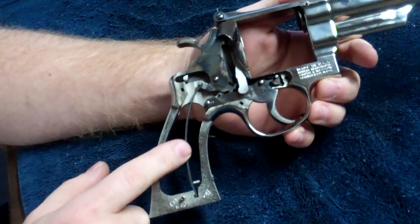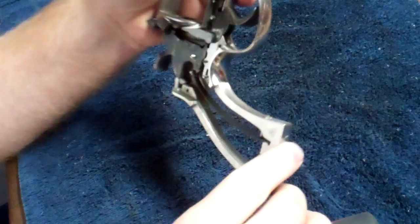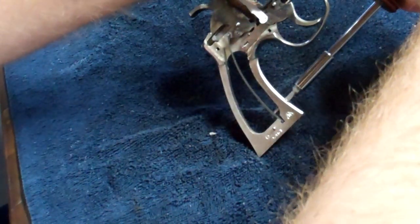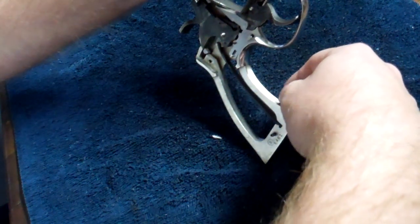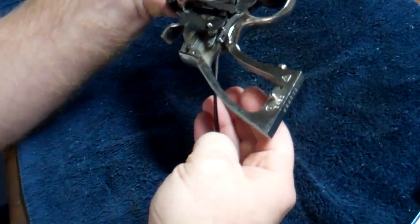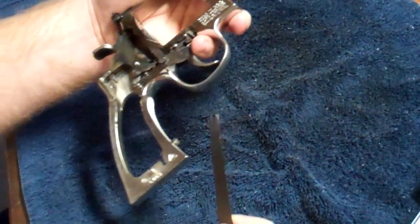The first thing we'll do is take the main spring off. Here's your main spring right here. There's a tension screw that you want to unscrew. Mine's sticking out about half a millimeter — I've actually loosened it up a little to lighten the trigger pull slightly. Most of yours will probably be screwed all the way in. Remember the position of it and take it out. As you unscrew it, the main spring will go kind of flat, releasing all the tension off the back where it connects to the hammer. You don't have to take the screw all the way out — this will fall right out. This is your main spring that connects to the back of the hammer with those two little prongs.